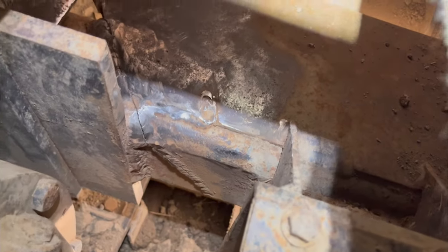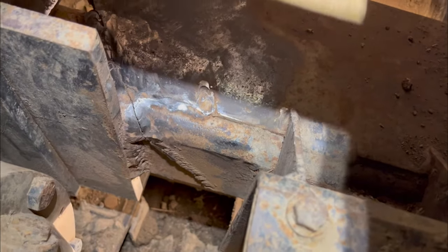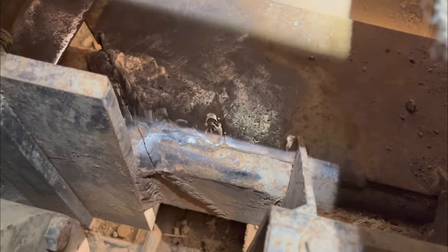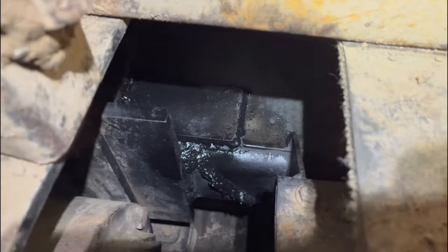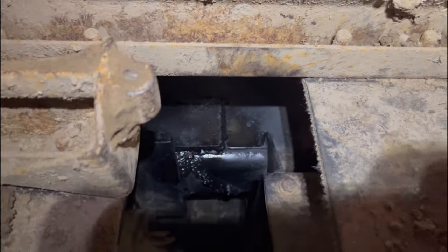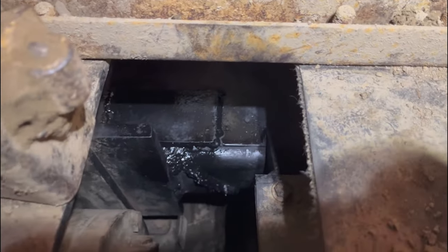This is bonus crack content. We're just cleaning the machine again, which I realize we should never do again because we always discover bad things. We're about to roll it out of the shop but we found another little crack here by the final drive. This one's very easy — I'm just going to weld it up real fast and put a little brace strap across it. Finished up — got plates on top and bottom, rewelded the crack three passes over. Should be good.